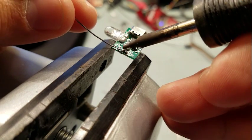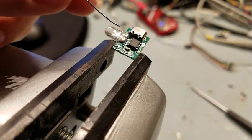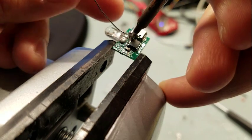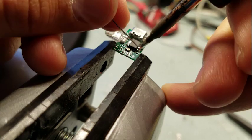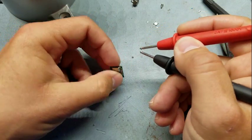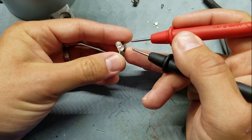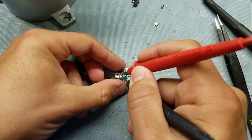This is a current limiting resistor for the base of the presumably BJT, because it's between pin 1 of that transistor and the microcontroller. I'm going to be replacing it with a MOSFET, so we won't need that to limit current anymore. Since I'm going to add a current limiting resistor for the main LED, I need to set what I want that drive current to be. Normally these just direct drive it, which is not really good for the LED or the battery, so I like to set that to a sane current.